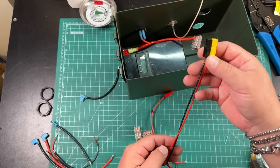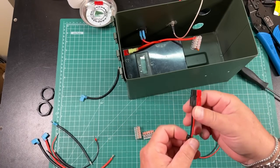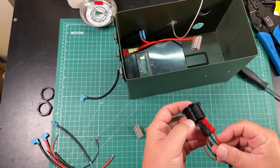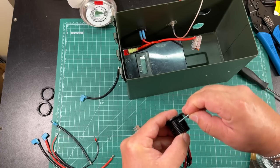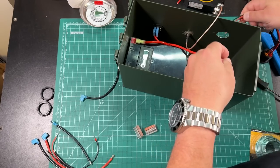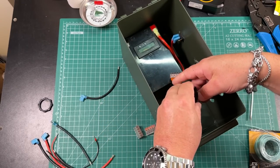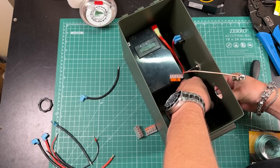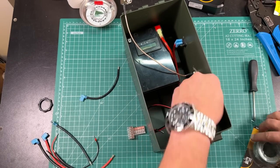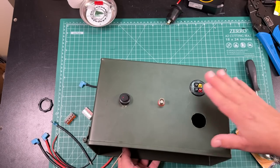Next, for our power poles — this black and yellow is what's going to be used to connect to the solar input, with power poles on one side and terminal connectors on the other. Then for the red and black, I have a red and black power pole with open ends that are going to connect to the Wagos. We can insert the power poles into the housing, then use this little metal wire — there's a hole inside this housing — that's what keeps these guys firmly seated. Then we fish our wire through and the nut holds it all in place. Now we have our power poles installed.